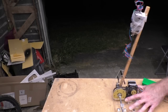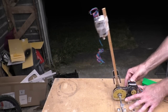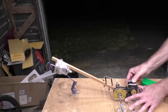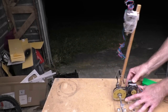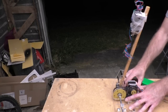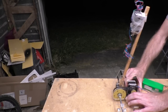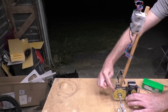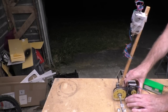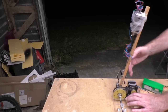Doesn't seem to be losing any steps. It's really critical that this motor section is pulled right back this way, because even if it's just a little bit not back enough, it tends to skip, or this belt in the middle slips on the small cog at the front. But I'm actually having to pull this top plate back a little bit just for this test to make sure it works, but when it is pulled back it seems to be alright.